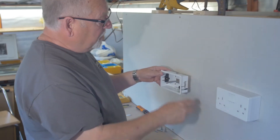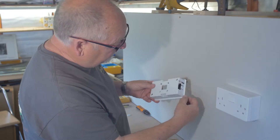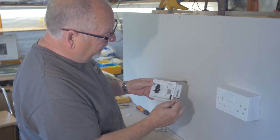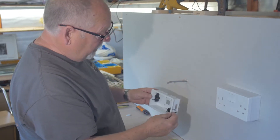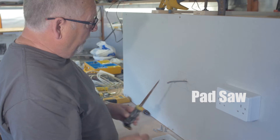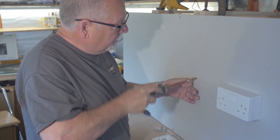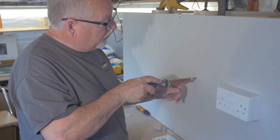Once you've cut out for the box, this box has a lip around the outside, so if you go slightly over the line when you cut, the lip will cover it and take care of any messy, unsightly edges to the cut. To cut out the plasterboard you'll need a pad saw — just push the saw through the wall. It's quite easy as it's only 15 millimeters thick.